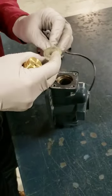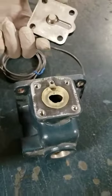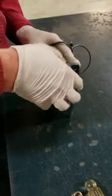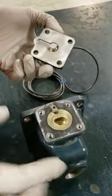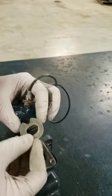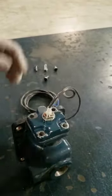If I put this bumper in here again, putting the notch toward the hole, you can see how it's going to be installed. It's going to have a lot more breathing room. At times that hole is lining up closely to the prox and not allowing enough air flow. So by just giving this room to breathe, it sometimes gets rid of pumps that have all the chatter. Line that up — the prox is installed, checking it below the surface so the spool won't hit it. Line this up, tighten this back down, and that's it.